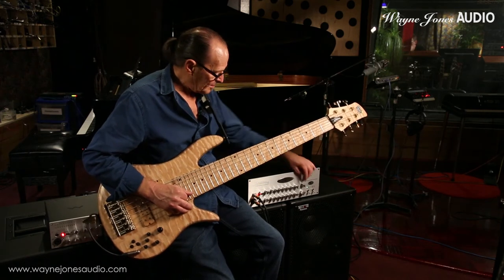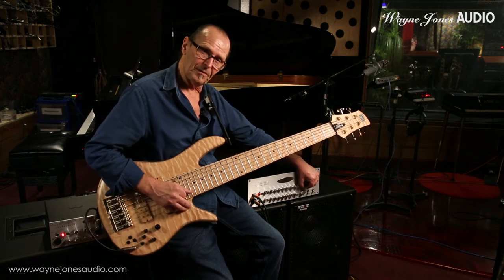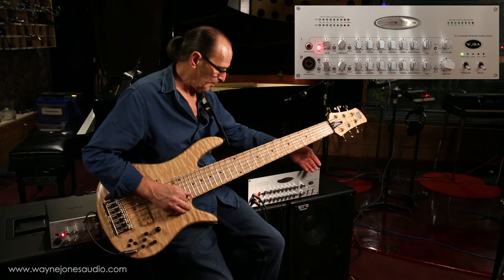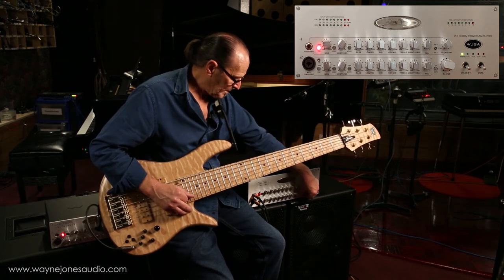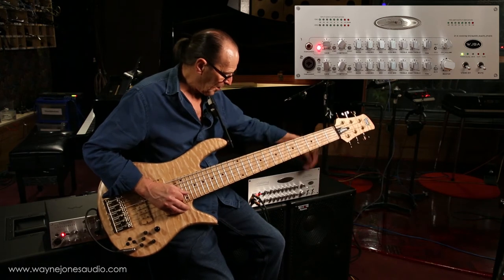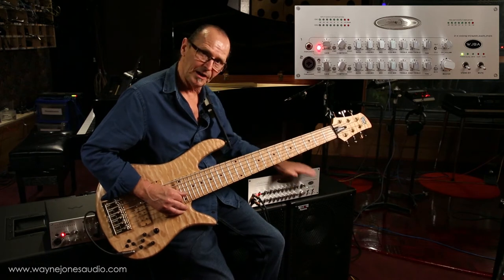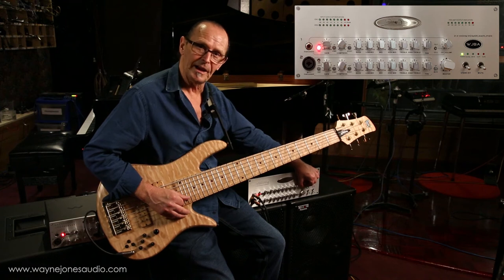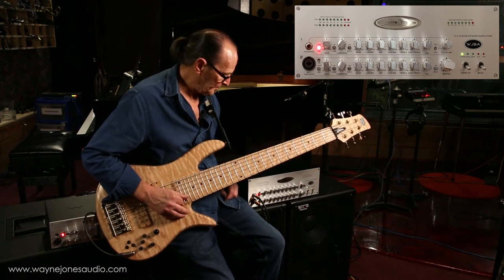The difference here is there is a volume for each channel. Channel A, you should leave full on. If you want to blend, the master will work on both, but as you turn it up, it'll change the balance. So you need to find a playing volume and then balance channel A to the master.